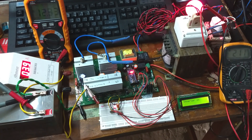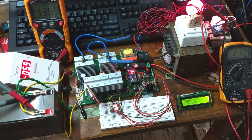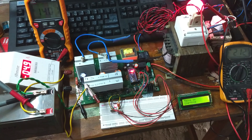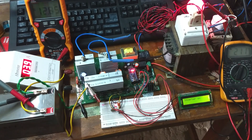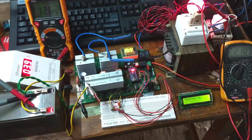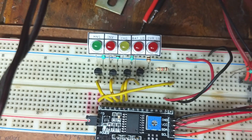Let's try again. It's in mains mode, charging is on, charging current is increasing. The charging voltage is fixed at 14 volt — it's in CV constant voltage mode. I turned off the mains and it went to inverter mode. During switchover, I noticed one problem: it's taking a long time — around 39 milliseconds, sometimes even more — to change over.